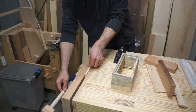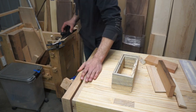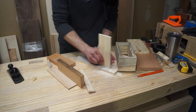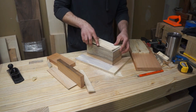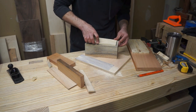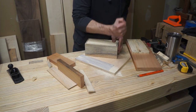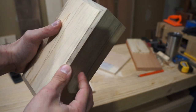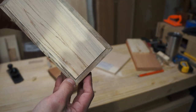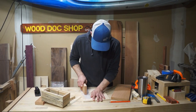After I finished the cuts on my crosscut sled, I took my block plane to the lid as well as the bottom piece in order to get a really snug fit. I also had a piece of stick-on sandpaper placed on a leftover piece of plywood to get those last couple millimeters for a true fit. I'm showing off a proud bottom piece here — that's to create a kind of illusion when I put the legs on at the end, as if the box is floating or has a separation between the two pieces.